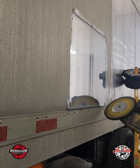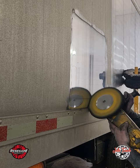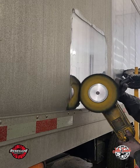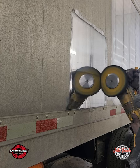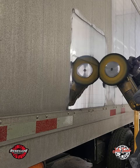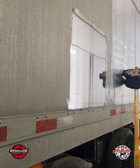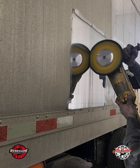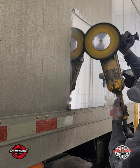I just switched over to a yellow buff, also at 6,000 RPM, with the same AAA compound. That's to refine the cutting marks. Once the cutting marks are refined, you can already see the shine getting a lot nicer and brighter. But if you really look in the light, it's still a bit hazy because it's still quite an aggressive step. This step really helps bring that surface to smooth so you can actually finish it really nicely. Reapply a little bit of compound once in a while and rake it back every time to keep it clean.